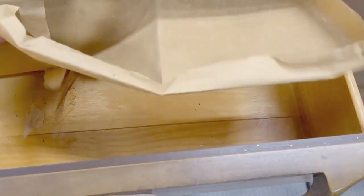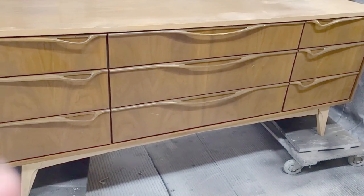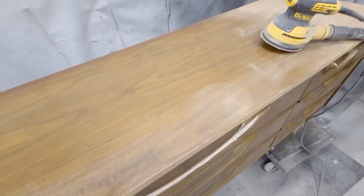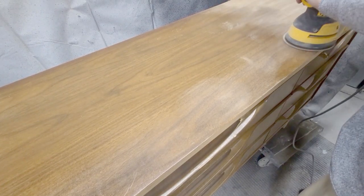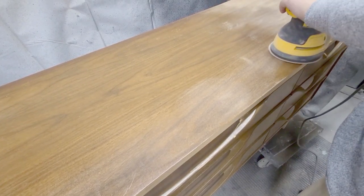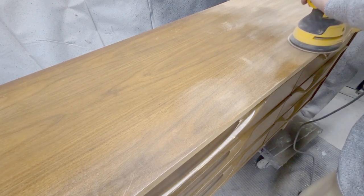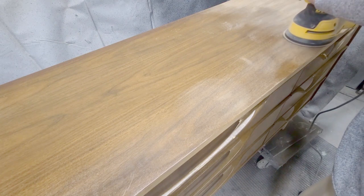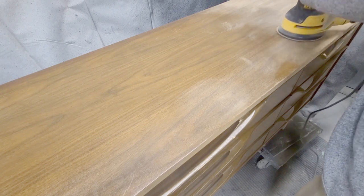As I opened up the drawers I noticed there was old paper in there, so I took that off and sanded the bottom of the drawer to remove the previous glue or whatever had stuck the paper. Once the legs were all sanded and ready to go, we put the piece upright and I started to sand the top. The top was wood veneer, but I still wanted the top to show wood, so I went very lightly using 80 grit sanding disc and took off that top stain.